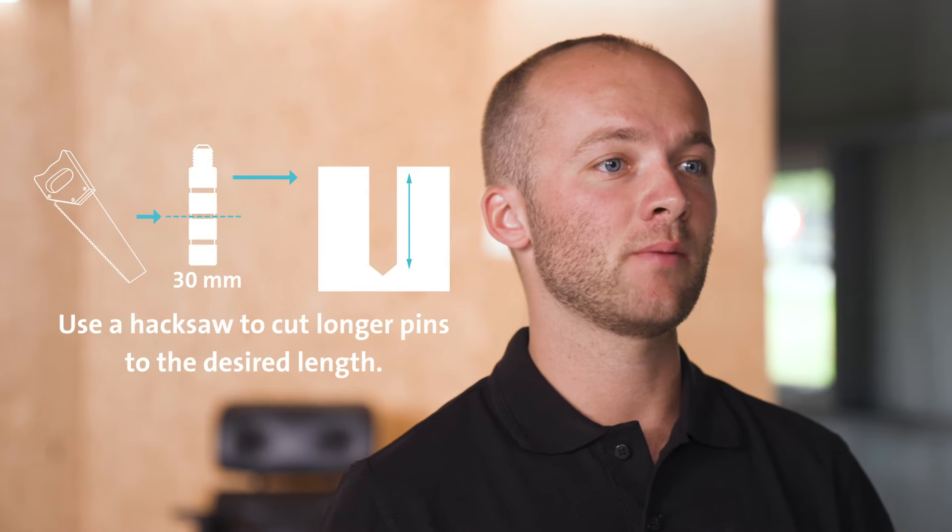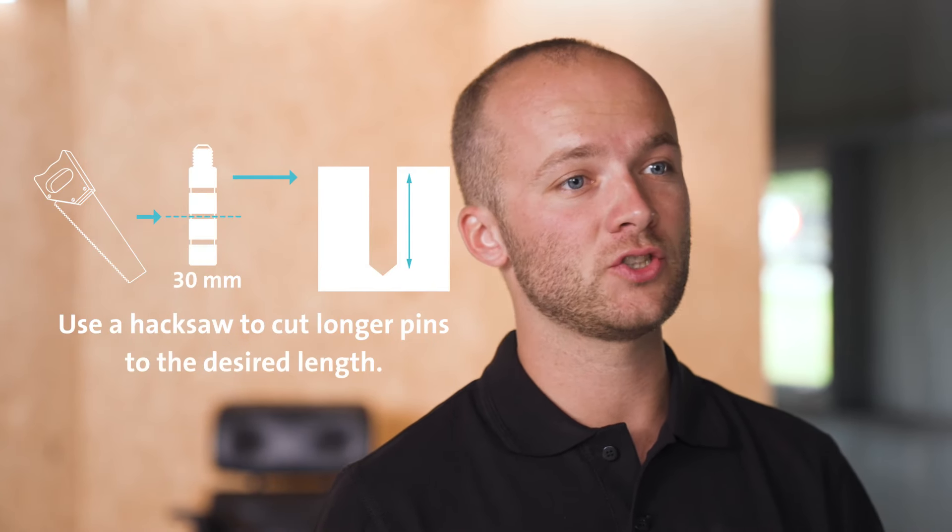When the top layer of your floor is not solid or we're not sure if the material is suited for 8 millimeter pins, we can always use the longer version of the pins. If needed, the 30 millimeter pins can be shortened with a hacksaw at the notches of the pins. If we have floor heating, we need to make sure the pins don't interfere with it. A solution is Fritz Juergens' floor plate flush, which is mortised inside the threshold flush with the floor so drop seals don't interfere with the floor plate.